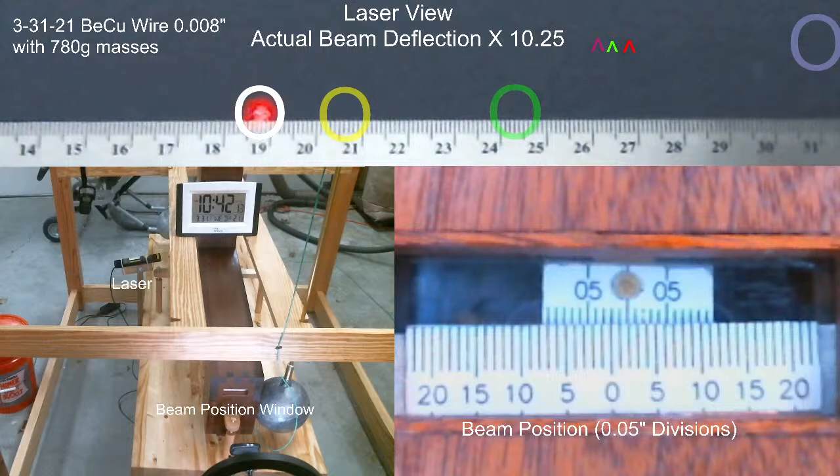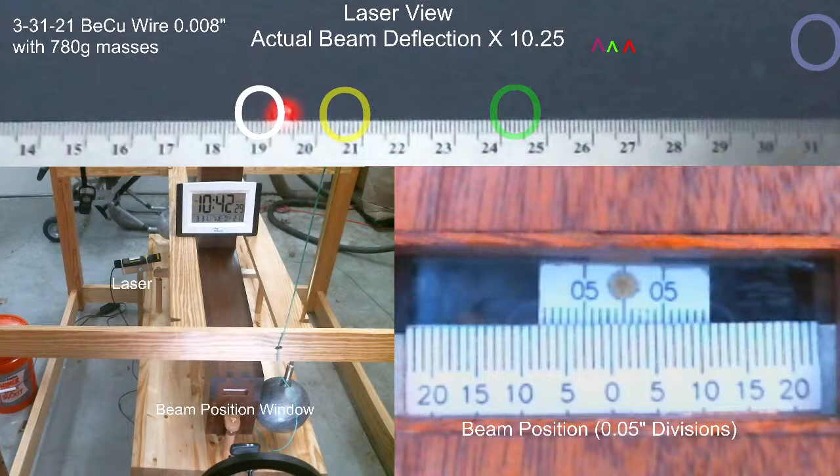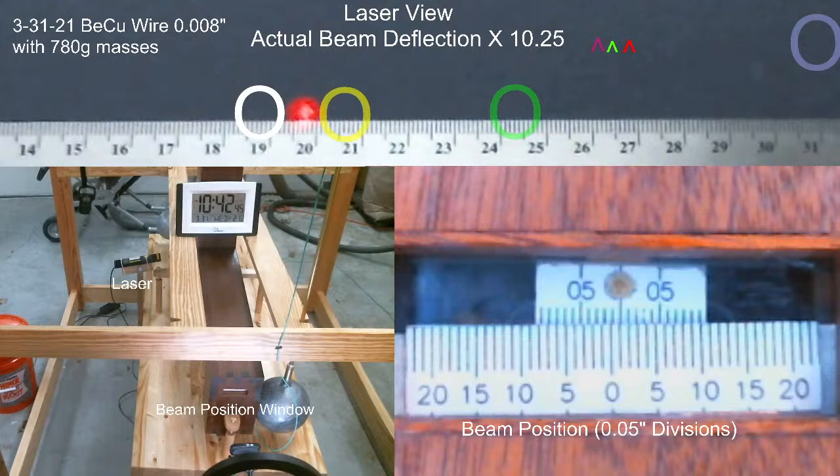I took it from the maximum point of deflection on the right-hand side when I moved the ball to the opposite position, so it swung all the way to its maximum on the other side. And when we averaged that a minute ago, if you remember, we got about 185 as the apparent middle. That's where we started, 185. So that makes perfect sense. The peak from one side to the peak on the other side would be 185. But now the deflection is offset to the other side.